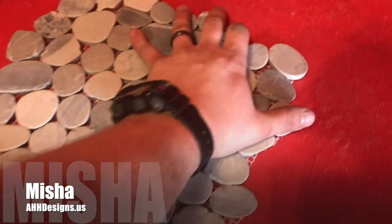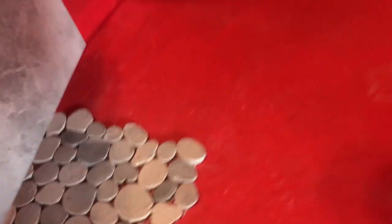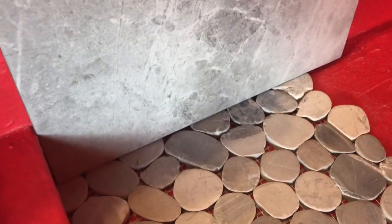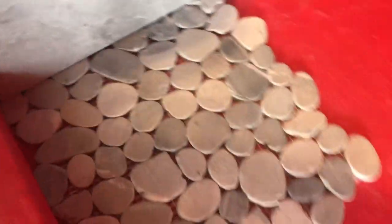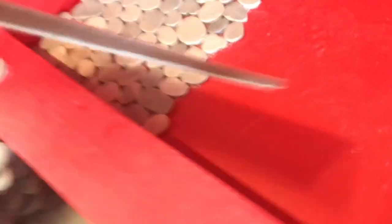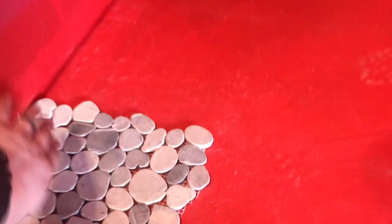So this will be my first piece — you see how it goes right into that gap and into this gap here, and what that gives me is this piece coming down over the top. That line there is just perfect. Once I put my piece in here the line is just perfect, and on a shower pan that's really hard to do, so I use this trick to help me do that.